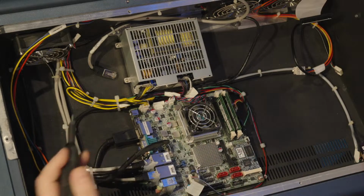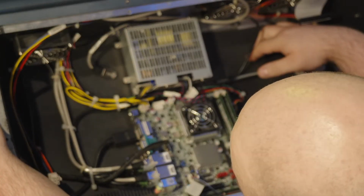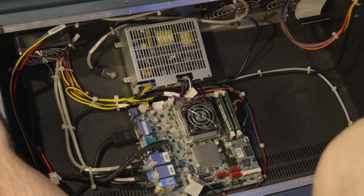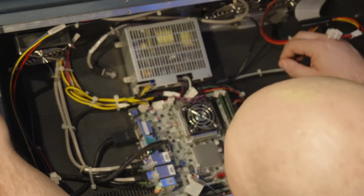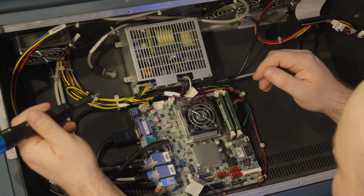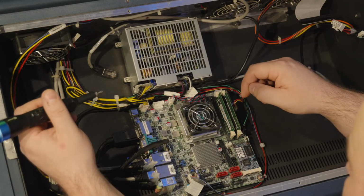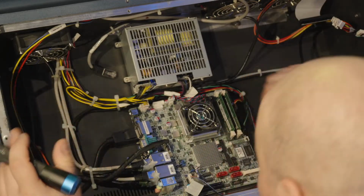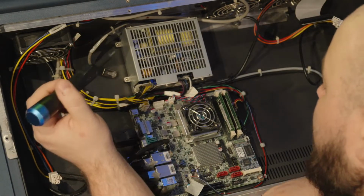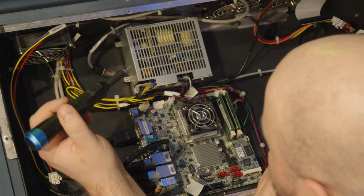Okay, so now that I have the console on top here, I don't see many power options available. I could, if I really want to, unplug one of the USB. Probably this USB here that looks like a regular USB, and I can probably put on a splitter there, like any USB splitter, and just get some power out of there into an adapter into the drive. That will be an option, but there's 3 SATA ports here. Do we have another M.2? I tried to not put my head in the way. I have another SATA port here. So we have another SATA port here in the bottom of the board. And that's pretty much it for now. Is there any fan? Nope. There is no fan power that I can harness to get some stuff.